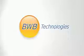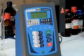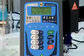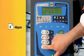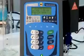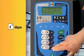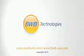The BWB XP will offer prompts as we go through the steps of calibration. From the main menu, choose calibrations. Go to calibrate ions and choose potassium. For a single point calibration, enter 1. Begin by aspirating the blank and press the blank key to begin the process. As the BWB XP is warming up, we recommend you aspirate the blank continuously. While waiting for the process to complete, we can follow its progress on the FP PC. When the blank is ready, we are prompted to enter the concentration of the standard. Key in 50 on the BWB XP and press accept. Start aspirating the 50 ppm potassium standard, press accept again and the calibration point will be determined. When the calibration is finished, tick on the retrieve calibration box and the FP PC will now be ready to report potassium readings.